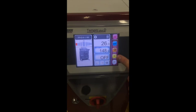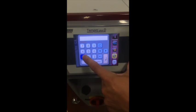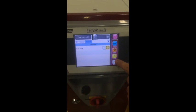Now we're going to make our way back to the functions menu. Various functions or operating methods are available depending on the device type and configuration. Within this menu, you can adjust the cool stop function, cooling to safety temperature, suction empty stop, regulation to set 2, exchange medium, direct cooling, enhanced cooling, and leak stoppage. Within the second tab, you can adjust the cooling water bypass and the input lock, which will require 153 to be entered in the password field that pops up. In-depth descriptions for these features are given on pages 73 to 76 of your manual.